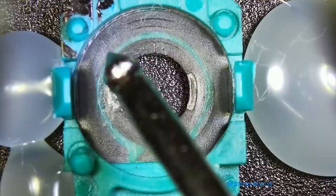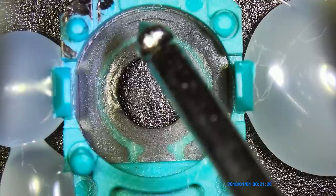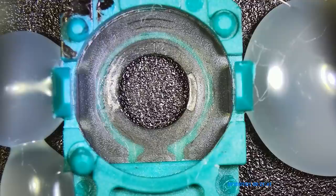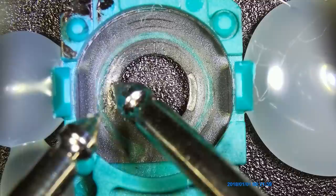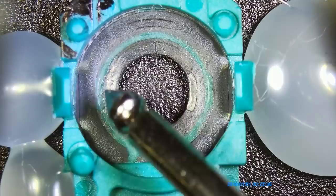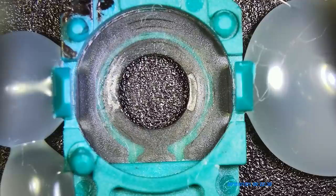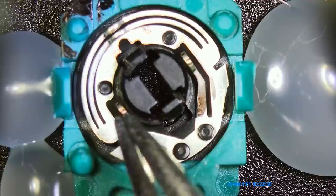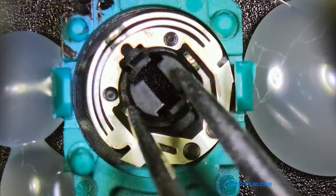So basically there was a shorter path — it biased. When it moved in this direction, it didn't even have to move — that's not stick drift, it's carbon film potentiometer failure. I scraped away more to verify there's metal underneath, but this was more worn away. Since this metal gives only 2 ohms resistance down to the wiper, there's less resistance in this direction, which means the pot biases that direction. You've got two tines touching the wiper in the middle, and one tine interfacing with the outer carbon ring.